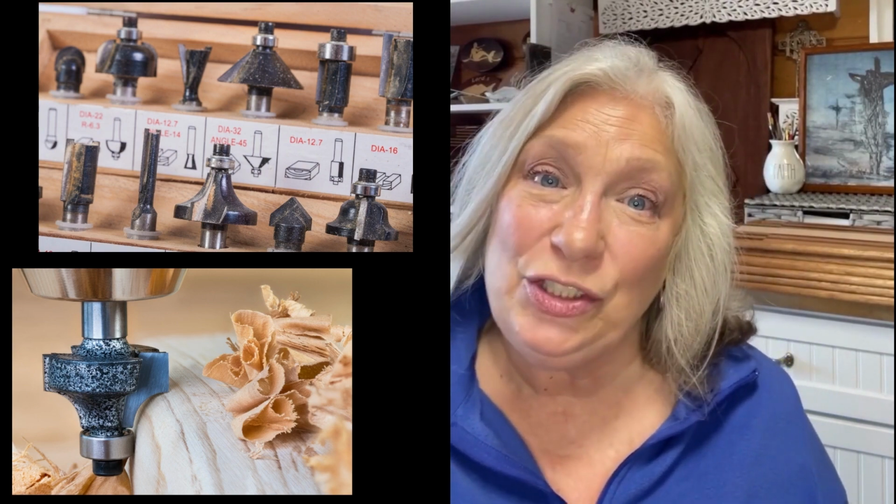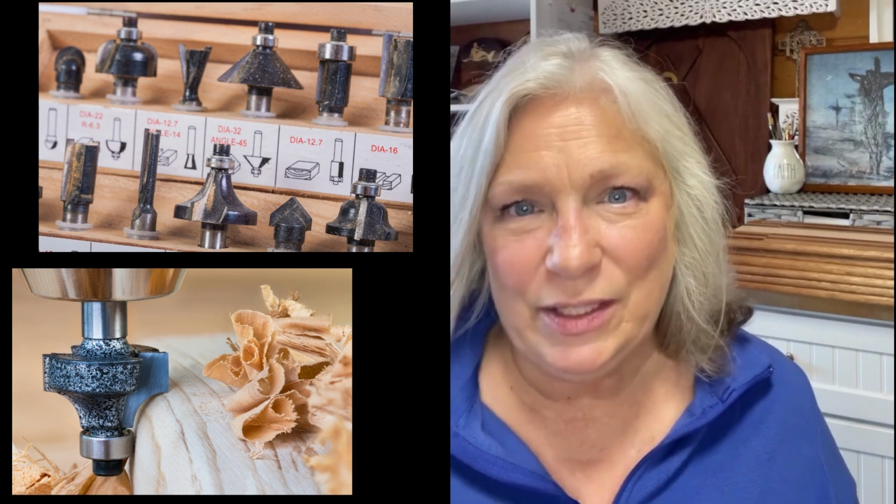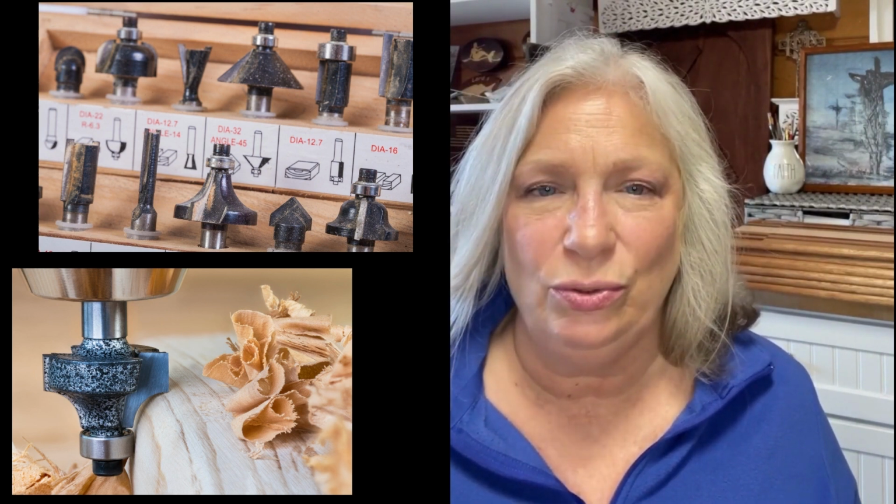So at this point, my part of things is done until we get to the finished work. I hand it over to Rich, who then creates the toolpaths from the file that I've created. He chooses what bits carve in what way and how the machine has to interpret the information. Now that we have the toolpaths, Rich will start the big CNC machine, which does the big bulk carving portions of the creation of the stations. It's basically a humongous router that carves things out the way that an artist and craftsman tell it to.